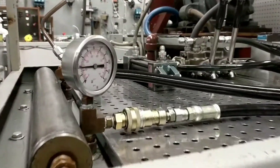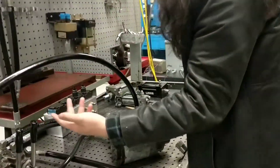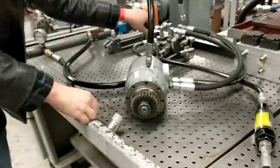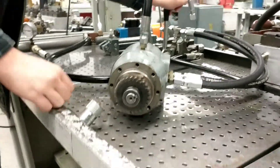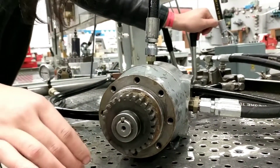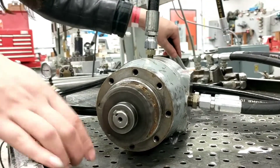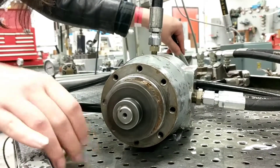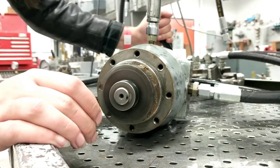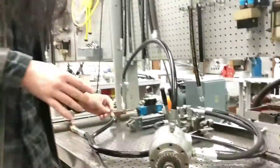These turn on right here, and then except for this lever, it goes by direction. So it's going clockwise. Now here you can actually adjust the speed. You can see it slowing down more and more. That's our flow control, and it actually goes both ways. So you have to set your max RPM that you want for the application. You don't want it running too fast for a wood chipper. You can just have it set, put the set screw in here so it can't be adjusted, and enter speed. Alright, and that summarizes our circuit. Have a good day.